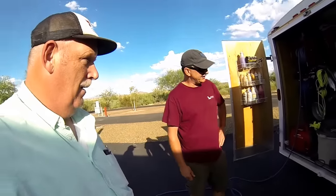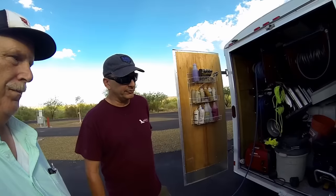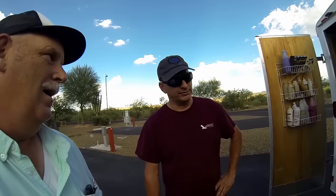Okay, so this is the next day. Todd from Diversified RV Care LLC, who actually lives here too, is going to give my RV an enema - yeah, pretty much. So the equipment we're using is a 3,600 PSI, five-and-a-half gallon-per-minute pressure washer, just cold water - we don't need hot water. It's very high pressure at lower volume than a garden hose, but it definitely does the trick.